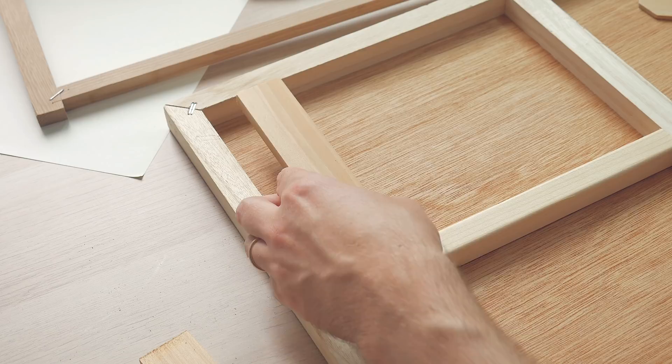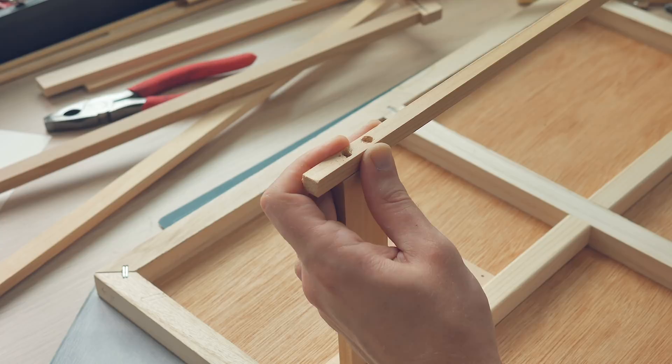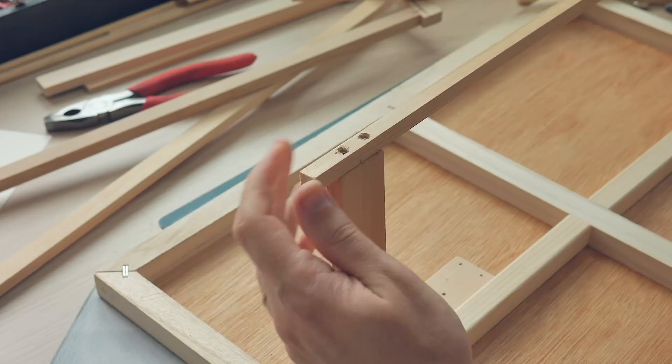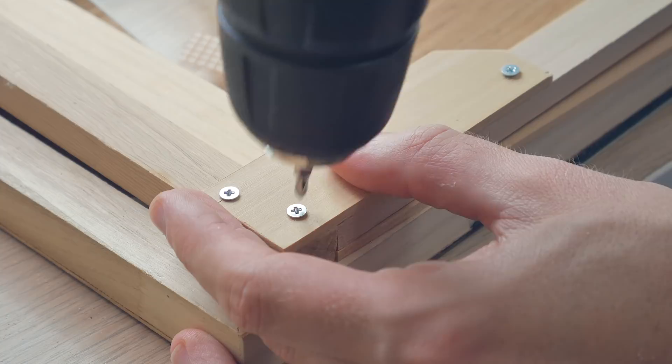This was quite difficult to do, especially because I also had to remember to keep everything square so the leg supports the board perfectly on both sides and everything is quite stable. I wanted this thing to be functional — I didn't pay so much attention to making it pretty this time. I treated this as a test version. I used a lot of screws and some thin wood pieces to hold everything together to make it as stiff as possible. It's not pretty but it worked really well and made the bottom frame really stable.